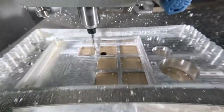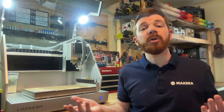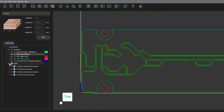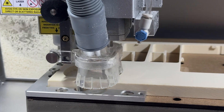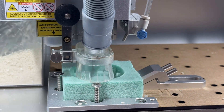You can learn more about choosing different bits like the spiral O in another one of our getting started videos. In order to ensure safe operations, setting up our machine and setting up our manufacturing projects is incredibly important. You always want to make sure that you're using the correct machine profiles in your CAM software and that you simulate your projects before manufacturing them. Additionally, we suggest running complex projects using softer materials to test our designs and settings first, as discussed in our choosing stock video.